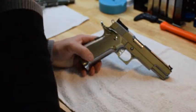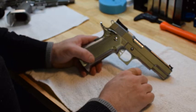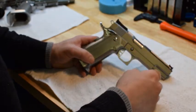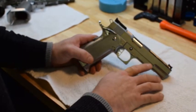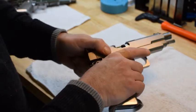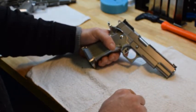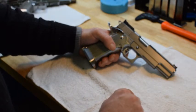Probably the Cadillac of gun coatings is plating. This is an electroless nickel with Teflon done by Robar — they call theirs NP3, and other companies do it as well. The process is: you take a clean metal part, dip it in liquid, and it comes out with added material — added nickel in this case. Hard chrome is done the same way. I like electroless nickel with Teflon; I like the way it looks, and the Teflon makes the gun run slicker the longer you run it. A gun with 10,000 rounds will be even slicker than brand new, because the Teflon is coming to the surface as the material wears. It does add a whole bunch of material, so the guns can't go in super tight or you won't be able to get them back together. We actually build guns that go out for this kind of coating with a little extra tolerance, and when they come back they typically won't fit together and we have to hand-lap them back on.